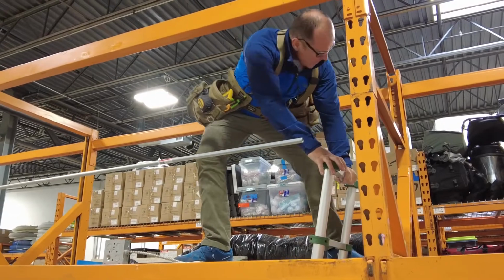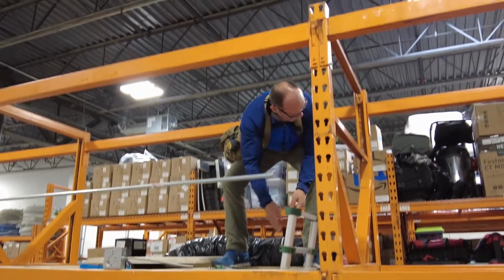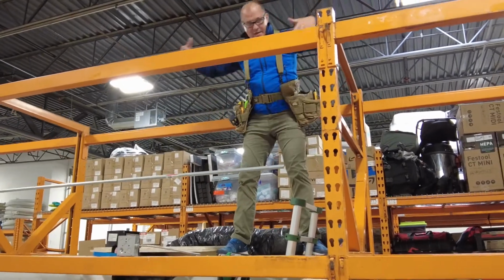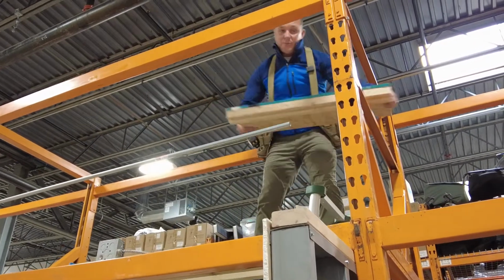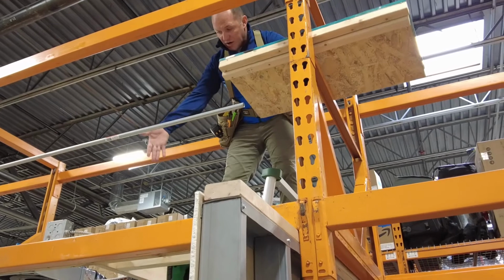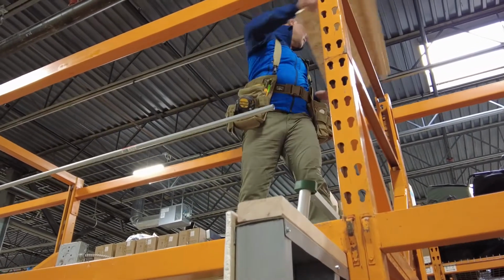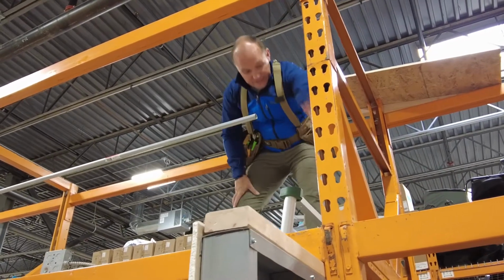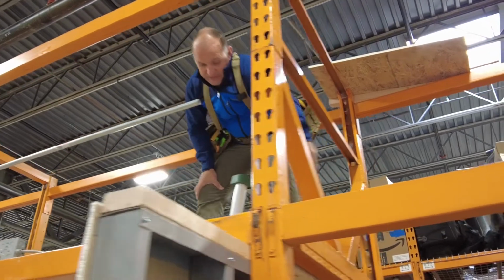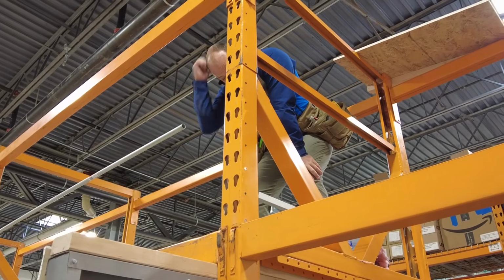All right. So when you're up here, most times you're always gonna have webbing, something to hold to. You're not just balancing. So I have 2 long sides, 2 short sides, right? When you have that webbing, you usually wanna put this up here. You don't wanna put anything on the drywall because it falls through. I'll put this up here, but there's always V's like this. You want to put stuff on top of these V's that aren't on light fixtures, that aren't on wires, that never are on the drywall. You never know how weak it is.